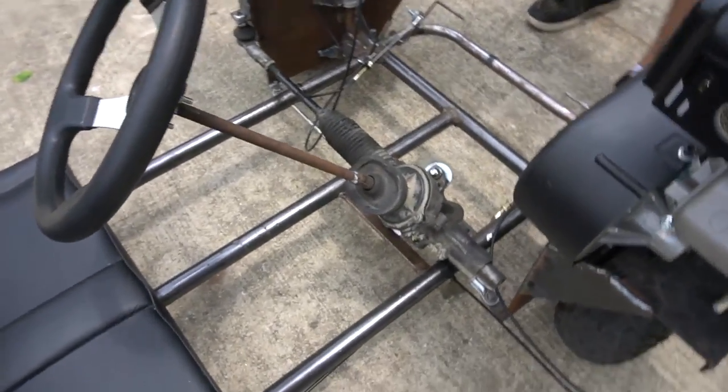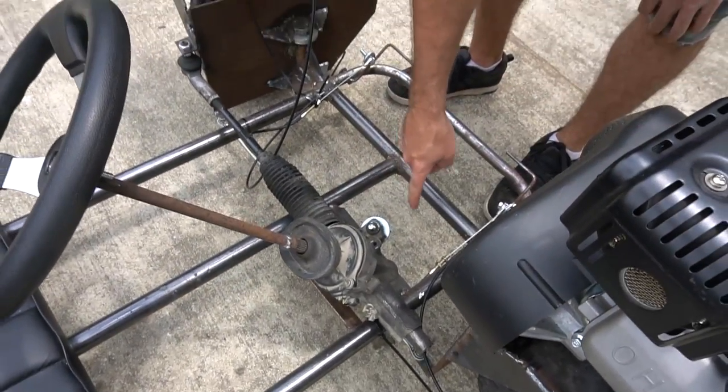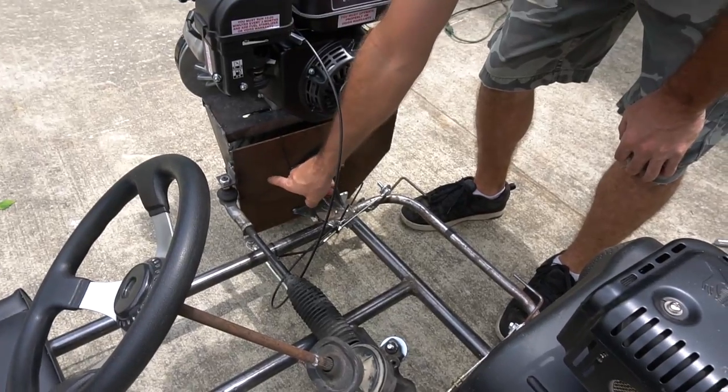So we're gonna do some more off-roading, but we're gonna fix the steering first. We're gonna tighten up the steering radius, make the steering more sensitive by basically relocating the steering rack, moving it forward. Yep. And then putting this there.